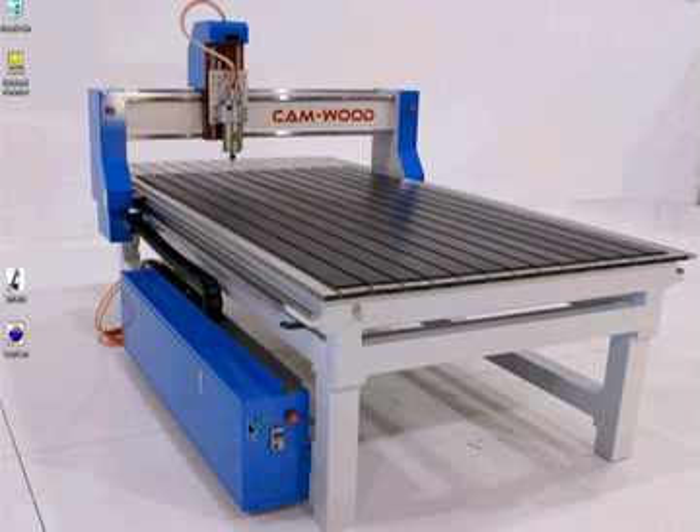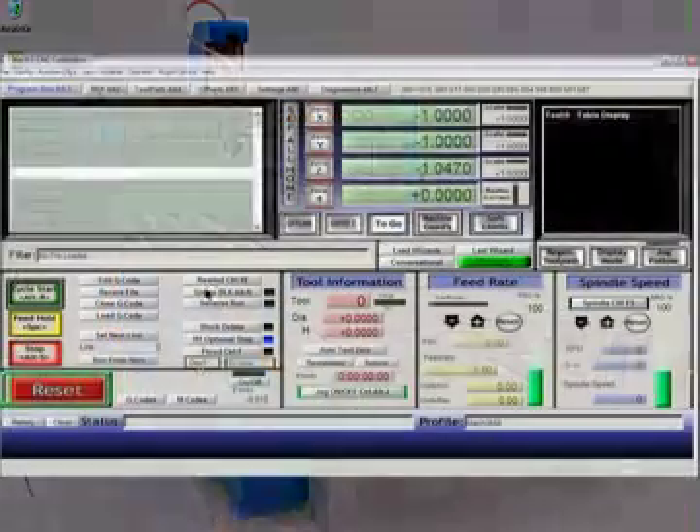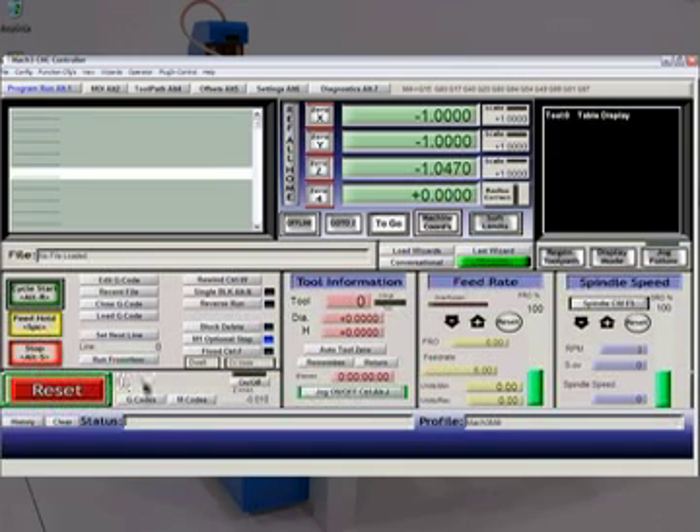When that's done, press the green button and once you press it, it will stay lit. You'll note that the machine will become live — you'll see it, feel it spring to life a little bit. It's going to jump a small amount and you'll hear the power on the machine. Go and notice if there are any alarms that come up on this screen.